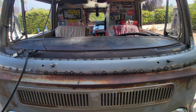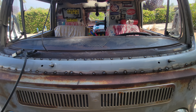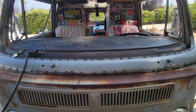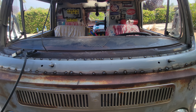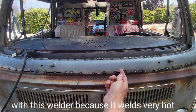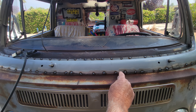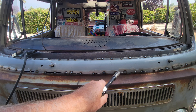Everything is based on small tack welds. If you do too much, just do a little tiny tack — as soon as that wire hits the surface, let off the trigger pretty much. You can't let it be on there very long at all. If you're burning holes, you're holding the trigger too long. The trick is to just barely let it hit — it will be enough to get it to hold. You're trying to get both surfaces. Sometimes when it's a real wide gap, I'll build up one side first and then do the other side, then wiggle it to make sure I get both very quickly.